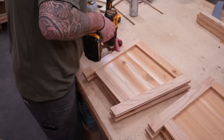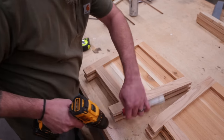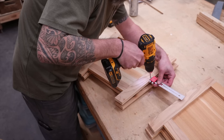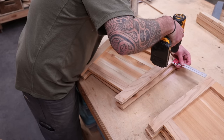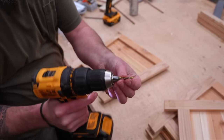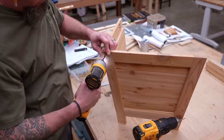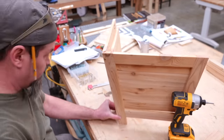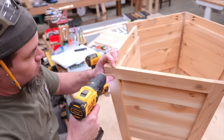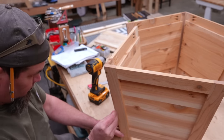With our four sidewalls assembled, let's attach them. We'll start by pre-drilling our screw holes in frames A — the top and bottom screws will be one inch in from the ends and the center screw will be centered, all one quarter of an inch from the outside edge. To attach the walls I'm using an inch and a quarter deck screw, so I'll set my bit to an inch and a quarter. Place frame B against the inside of frame A, and using the holes already pre-drilled in A, pre-drill again so it reaches frame B. Install your screws and repeat for the remaining sidewalls A and B.